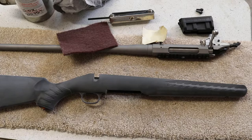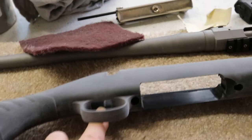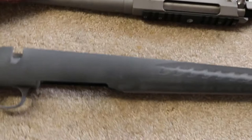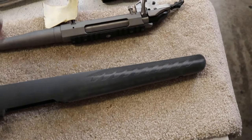I've got everything sanded and buffed. Just a couple of words about sanding: you never want to sand inside any holes or inside where the barrel is going to be. You don't want to loosen areas that are supposed to be tight, or spray paint in areas that are supposed to be loose — that can affect a lot of things. You may not even be able to get your gun back together, and if you did it wouldn't be as accurate.